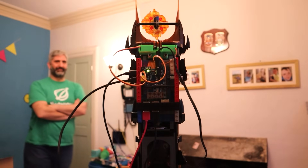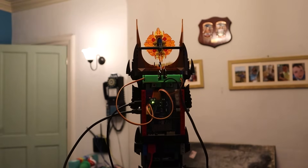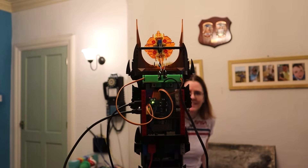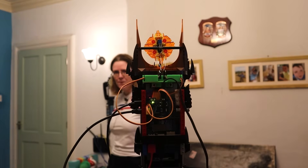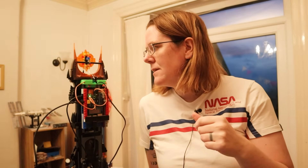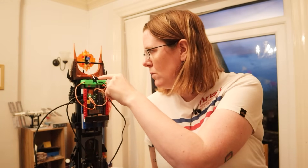That's quite freaky! So that's this week's project finished. How would you have done this differently? One thing I would change is the wire to the eye — even after just a few times it's starting to bend and the calibration is now off. So I might look at using a sturdier wire, but the problem is I have to be able to bend the wire to put it into the servo horn and onto the Lego piece. How do I get a strong piece of wire that's thin enough to bend, but won't bend under pressure?